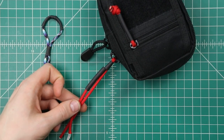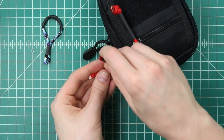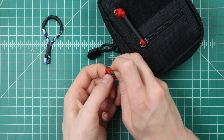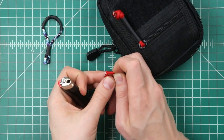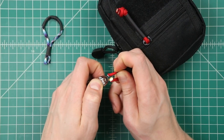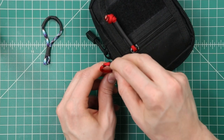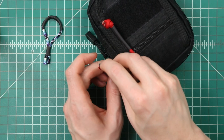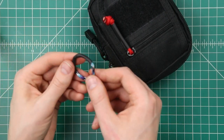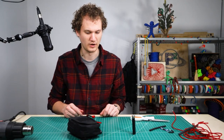Go ahead and cut your cord just past that. Then we need to melt our ends together before we go any farther — kind of bend that over to the side and do our little melt. If you use the adhesive lined stuff then you don't have to do this step, so that is kind of a bonus of that variety. Hold that together. Then we can slide that heat shrink up over the top of that. You want to keep it relatively straight so you don't get any kinks in there. This one didn't turn out perfect but I was melting this one with a lighter — just be prepared that if you use a lighter it's not going to turn out quite as smoothly.